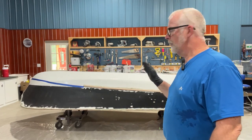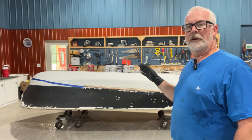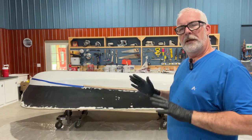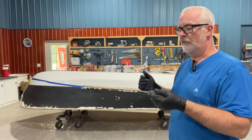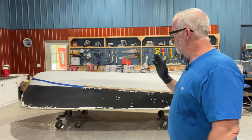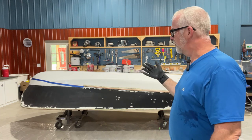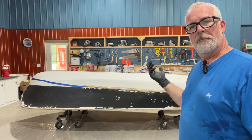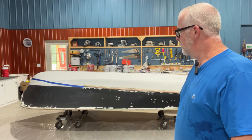I now have the water line taped out. When you're in the room it looks different than on camera — the water line looks wrong because you're seeing the complex shape of the hull as it curves and turns, while the laser only sees a straight line. That's what it'll look like in the water too; the water will be a straight line around the hull as it displaces. It's a little unnerving because you think it doesn't look right. I also use the spray rail as a guide to look down and confirm it's following correctly. Now I'll go around and do the port side, then we'll be ready to prime.